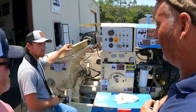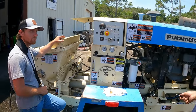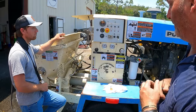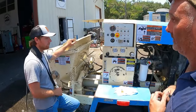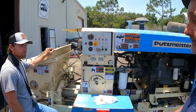That's what I would do if I lost all hydraulic power. But if I lost just electrical and I got a forklift hooked to me and I got it running, I come over here and switch over, wash out, switch it one more time. Boom, I'm done, let's go. Get back to the house, find out what happened, whether it threw up, burned the belt out, cylinder went out, or the proximity switch fell off, whatever. But you see it kind of making sense now, you know?